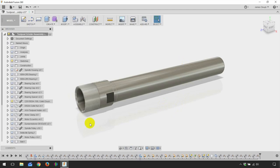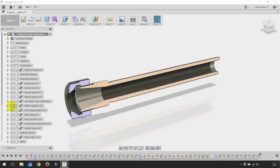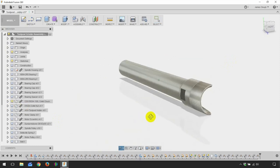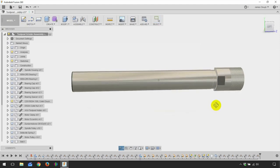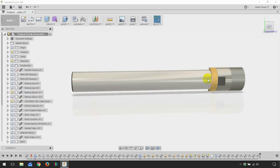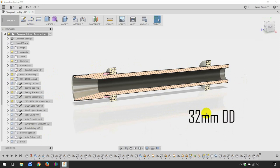This is Fusion 360, and this is what I started the design with — a model of the ER20 collet holder. Turning to a cross-section, you can see it's bored through and has the taper in the front and the threads to hold the collet nut. Looking at the shape, we've got a cylindrical shank to hold the bearings, but there's a relief cut up at the front near the shoulder so they don't have to grind a sharp inside corner. I actually need that to be a square shoulder so everything can register, and since I can't run the bearing all the way up there, I'll need some kind of spacer. The design will have a spacer to space the bearing off, and ultimately two bearings on the shaft — 32mm outside diameter, 20mm inside diameter.